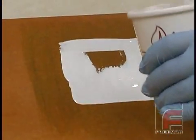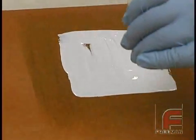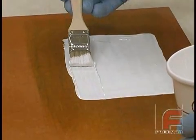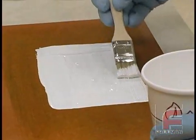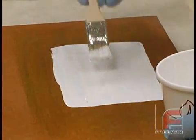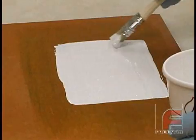Normally, you'll want to apply two surface coat layers to make sure your part is covered with at least a 16th of an inch of material. This is especially important when you are working on vertical surfaces. Plus, you will want the surface coat layer thick enough in case you need to perform any touch-up work later. If a layer of surface coat is too thin, this may expose the fiberglass cloth underneath if any repair work needs to be completed on the tool face.